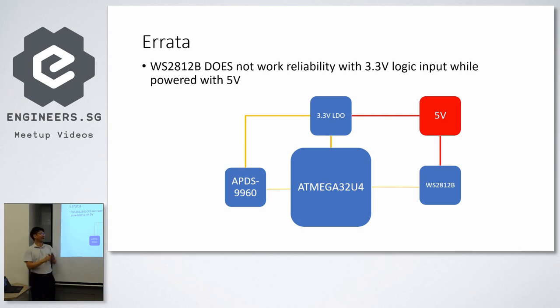This time what we found is, it's almost the same thing, because this sensor is using 3.3-volt I/O, so it forced my controller to run at 3.3-volt, and the NeoPixels are running at 5-volt. And when I did the same thing again, I found it works, but it's very unstable. Sometimes the picture gets distorted, sometimes the color changes. And we did some tests and found when I power this whole thing using a battery, it actually works. But using USB 5-volt, it doesn't work.